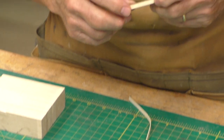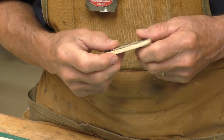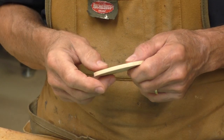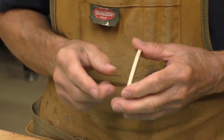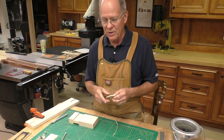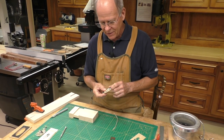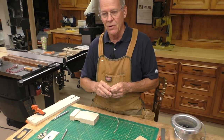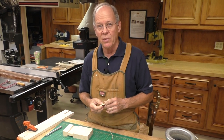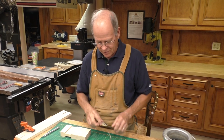I always put my seam at the top right. I just got in the pattern of doing that, nothing magical about it. But you can see on this one, I talked about the width, the depth of this. I wanted a wide surface to put glue on. The first couple I made them only about a 16th of an inch, with a backing on it. And I'd made some other inlays before, fans and things, and even the bell flowers on this are only about a 16th inch thick, and you just lay those in. But when I tried gluing a banding on a piece that was only a 16th inch wide, I had difficulty getting it to sit square and uniform, and the seam and joint was just always ugly. So the outgrowth of making this bigger is I got a better glue surface.